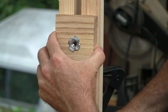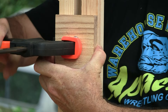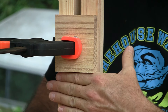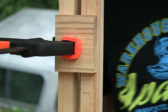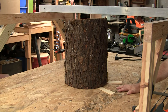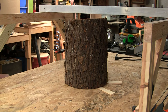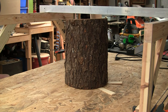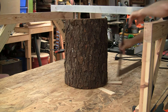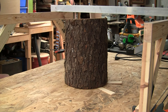Then I clamped these blocks exactly on that mark. That will make it real easy for me to drop this thing down until the bottoms rest on the table — I'll have all four uprights exactly at the same level. I put some shims under the rough end of the log to give it some stability and to get that thing as close to square as it's going to be. Of course it will never be perfect, but that's pretty darn good. Then I tossed some sandbags against the base of the log for some added stability.